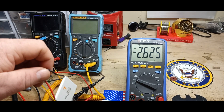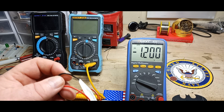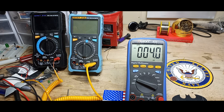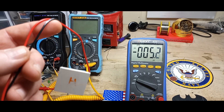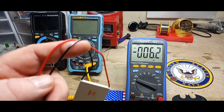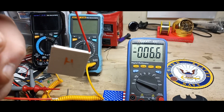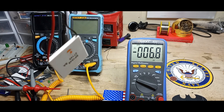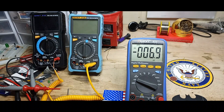I know you're thinking that's not enough to charge your phone, but you can put two, three, or four of these together — however many are in your 12 volt ice chest. Connect them in series to increase voltage, or in parallel to increase current. This one has a maximum current of about 700 milliamps, and your phone will charge at 700 milliamps — it'll just take a little longer. If you're trapped in the canyon lands of Utah with no other way to get electricity, you'll be glad to know that.